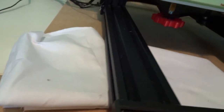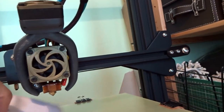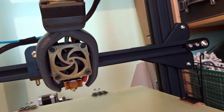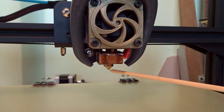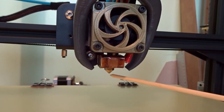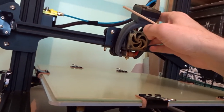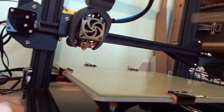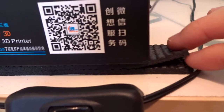These are pure 100% cotton cloths — super useful. When you've got filament on your nozzle, and you'll have a lot of filament on there all the time, you can just wipe it off while it's hot and it'll clean right off. Don't put any metal tools on that nozzle — the nozzle is only brass and it will scratch. Any scratches near the nozzle exit mean you no longer have a perfectly round surface for the filament to come out of, and that will show up in your print. Just use a soft cloth, wipe it when hot.